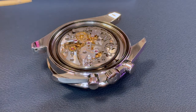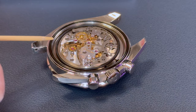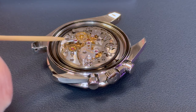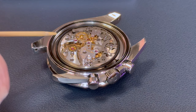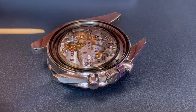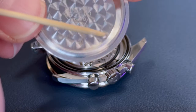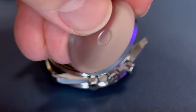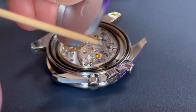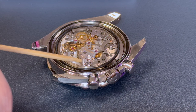The first thing: comments around how to secure the case to the movement holder. The movement holder clamps to the movement but it's not fixed to the case, so it will move within. Normally on the original case back you have a ledge here that bears down around the anti-magnetic shield, and that edge bears down onto the movement holder, which holds it in place.